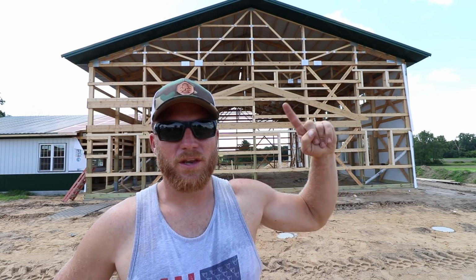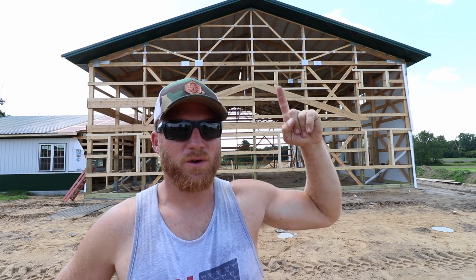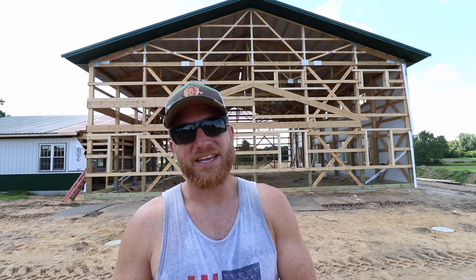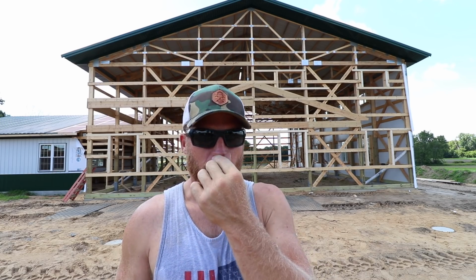Got all these windows framed. This was the tricky one right here, just because it's really close to the porch roof, and I think it's still far enough away. That 2x12 is actually above the roof line. That's there not really for structure as much as just a big space to tack all my flashings and screw my steel to, coming down that sidewall or end wall steel. So it's not going to be that close. It'll be at least a foot away from the roof, which I like, to stay off of roof lines for splashing of water and whatnot.